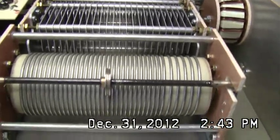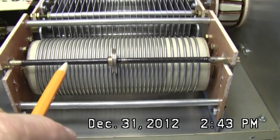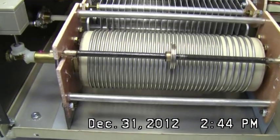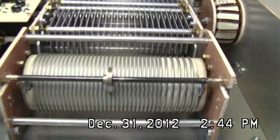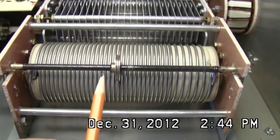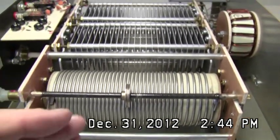Once the coil is cleaned, here's something important. See this bar right here — that's what the rotary connector rolls on. If that becomes dry or oxidizes from the air, this rotary connector roller will not make proper contact with the bar, giving you intermittent connection. That's one of the problems with these tuners — as you're cranking to tune your antenna it fluctuates all over. You need to clean this bar, maybe with fine steel wool. Notice the bar is dark — that's because there's a grease on there, and that's a factory secret. These come from Palstar with a very light coating of grease, and I found that coating on mine was so thin and sporadic that I was getting dead spots.